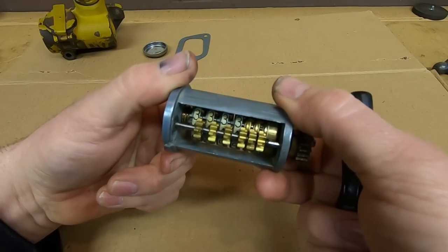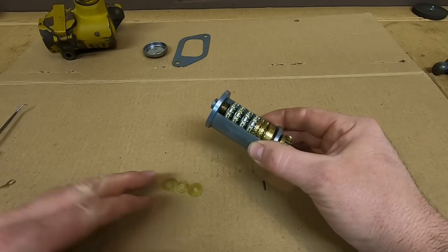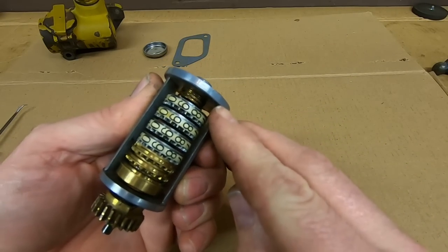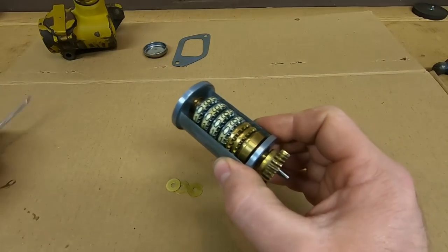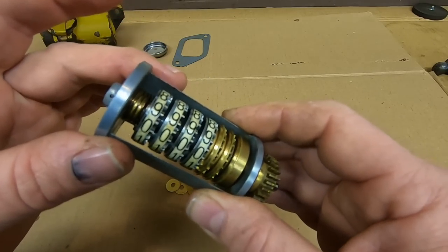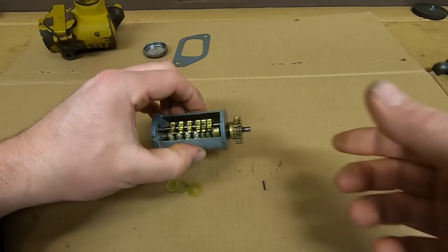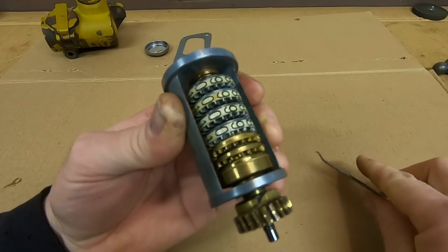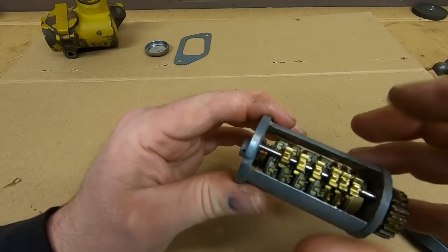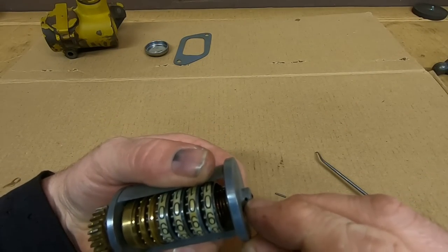Okay, we're starting in the bushing, all the small pinions look right — liking it so far. With everything in place, the final three pieces are these thin little shims — three of them — they have to go in between the spring and the end cap of the housing. I'll take a pick and gently pull that spring back enough to slide them down in there. A little grease holds them all together as a three-pack so you're only trying to align all those holes at once. Once those are in place, advance the main shaft through, and then drive the little roll pin down through there to lock this whole thing together.